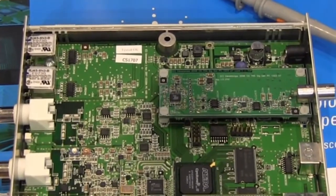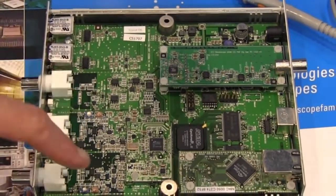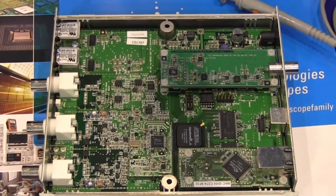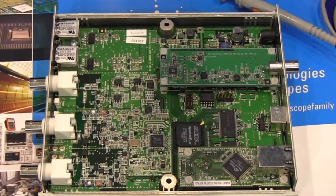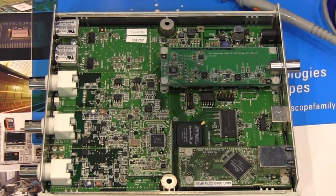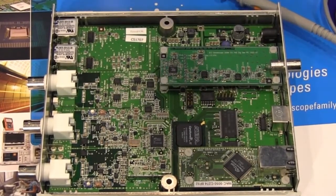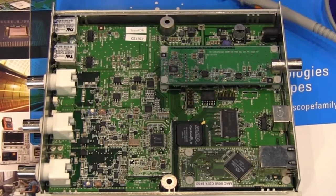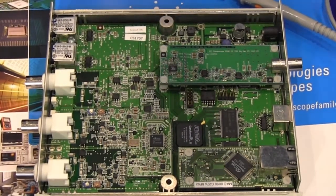So this is the digitizer. We do them in 10, 12, and 14 bits — so this is a 14-bit digitizer. And this is all the analog stuff. Over here we have DC offset, which is so that we can look at just a small chunk of range, like 2.1 to 2.2 volts, and digitize across just that chunk. Over here we have our mixed signal input — the eight digital lines. Not too many PC scopes do that. And over here is an Altera Cyclone — a magnificent device. That's where all the magic is running, and we can change it — people can upgrade their hardware in the field.